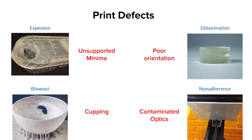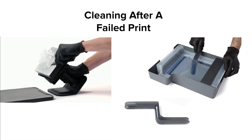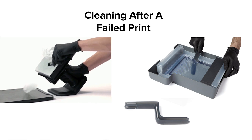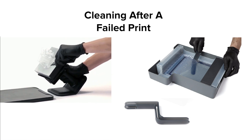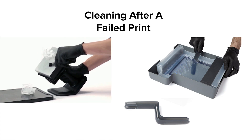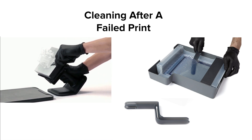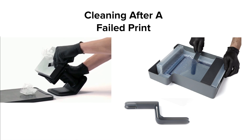Non-adherence is most often caused by contaminated optical surfaces, such as a dirty optical window or contaminated or damaged resin tank. If your print fails, do some checks before starting your next print. If you'd like your failure evaluated by the Formlabs support team, take pictures of your failed print on the build platform prior to removing it. Failed prints should still be washed to remove excess resin before disposing of them. Next, remove the tank from the printer and place it in the tank storage box or on a clean work surface.